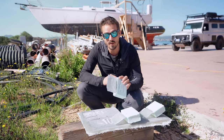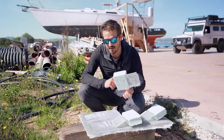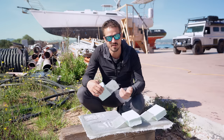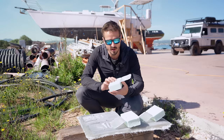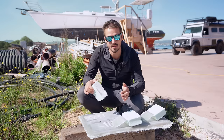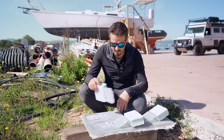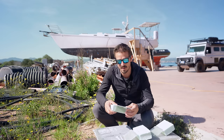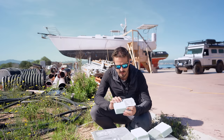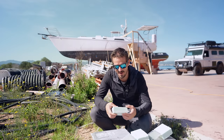Why we didn't do that before is because we were told you can laminate directly over peel ply once you take it off. Maybe on larger samples that works, or maybe if we laminated quicker — like took the peel ply off the next day and laminated rather than waiting a week — maybe that makes a difference. We have heard from some reputable boat builders that that's what they do. But in our experiments, cleaning and grinding made the most difference. So we're going to go back to our old ways: clean it first, grind it down, then laminate. The grinding was the biggest variable in all our tests. Our faith has been restored in this repair and our trust is back in the system.